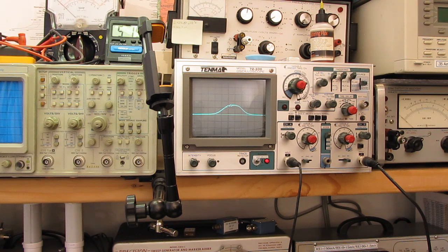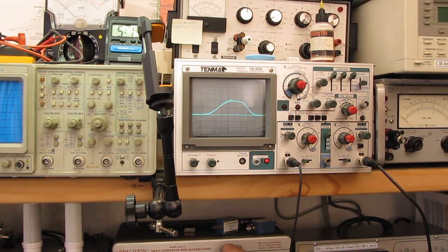So I'm going to dial in. Whoops, that's 10 dB. That's another 20. There's 10 dB. There's 15 dB, a little too much. 10, 11, 12. Yeah, we'll leave it there. Now, you can see the generator's drifted on us already. It doesn't take these things long to get out of. Oh, too much. That puts us in the center.